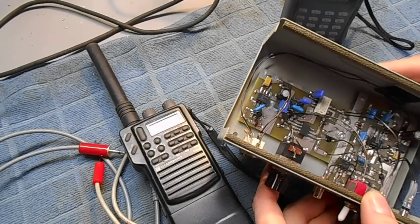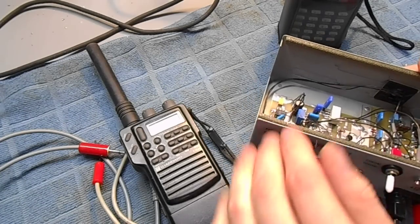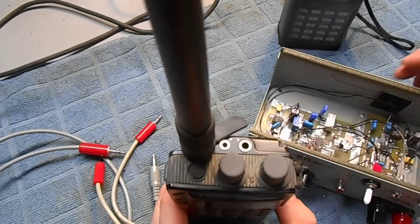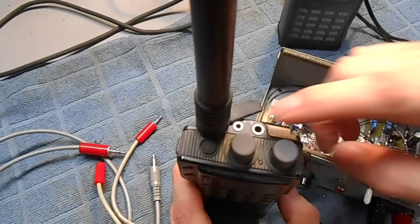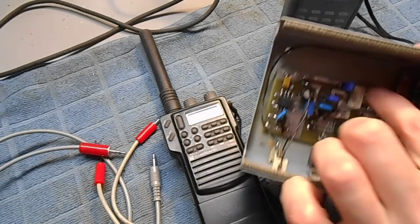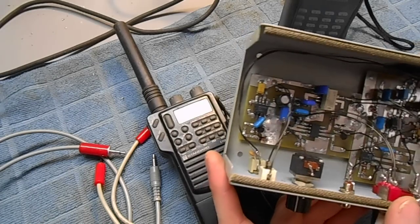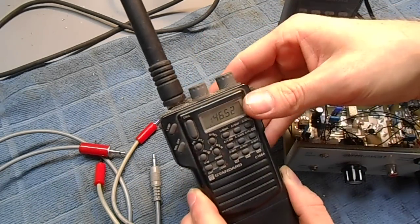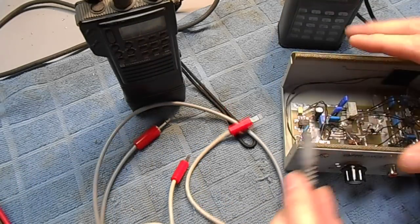This pulse from the 555 timer triggers a relay, and the relay controls the PTT control which then goes to the microphone control on your jamming transceiver. Most common two-way or amateur radios are keyed to ground to transmit, and using the relay is just a hard way of grounding that control signal. In this example we're going to jam 146.52 MHz.